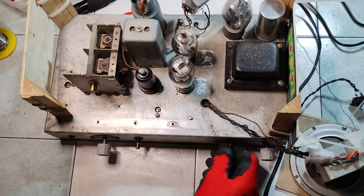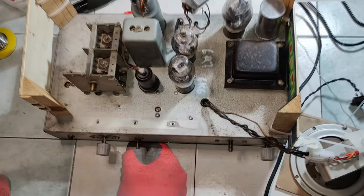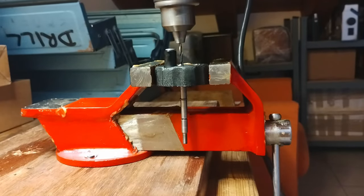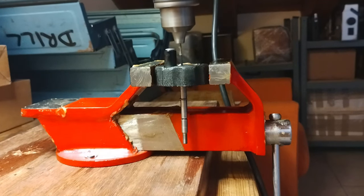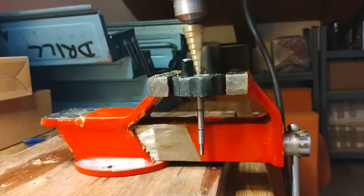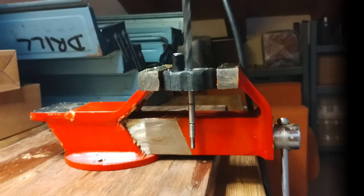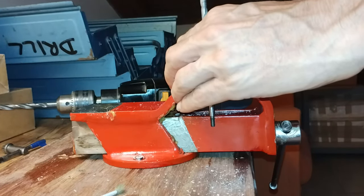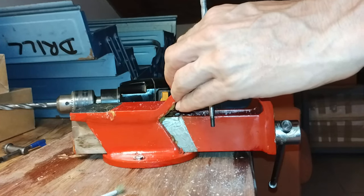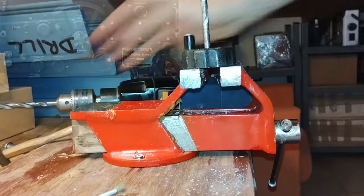The beat frequency oscillator is working. The knobs should be removable. Therefore, everything was tried to separate the main tuning knob from its shaft. Drilling a hole on top of the knob to push down the shaft from there is the only option that worked. By the way, this particular knob might have come from a BC-348 receiver, which is sad.